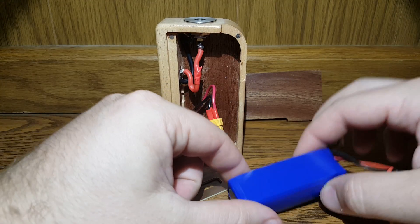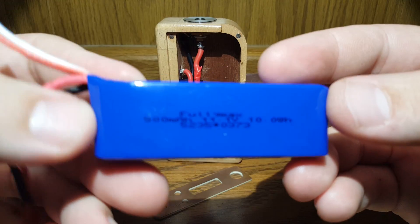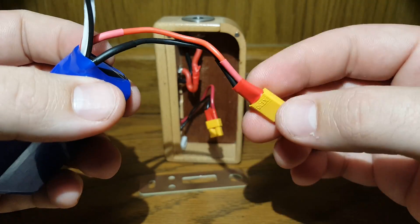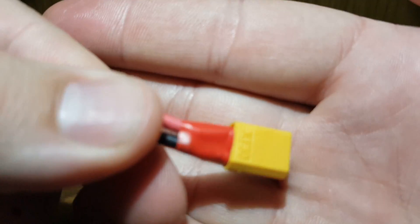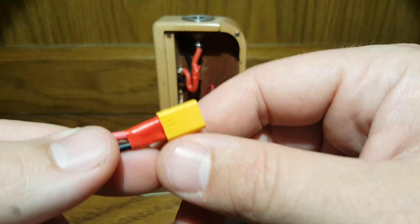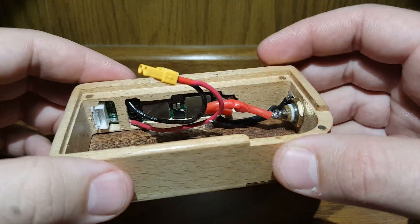So option number two - the option I went with. On the Evolv website they're selling this battery here: 900 milliamp hour, 10 watt hours, 3S LiPo, 11.1 volts. It's already rigged up with the tap, but it came without any connection on it, just the wires. So I went ahead and got these XT30 connectors - I think they also call them banana plugs - and connected these up. You want to put your female on your battery and your male on your connection.